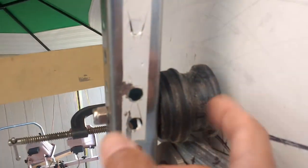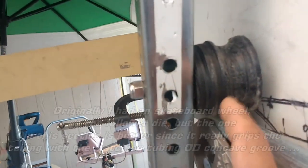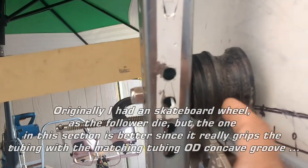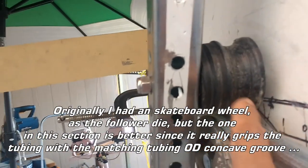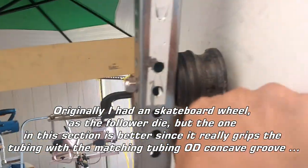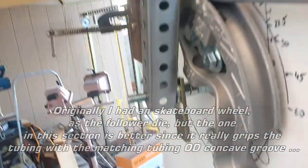I've also had to do this pulley here. I had a piece of ABS. This is about 2-inch diameter round stock ABS. I had to machine this down on the lathe to create the curvature, to have a little better grip here as the pipe is wrapping around.